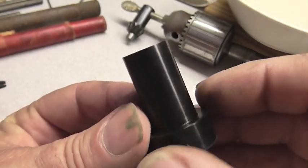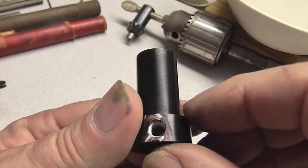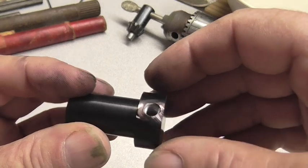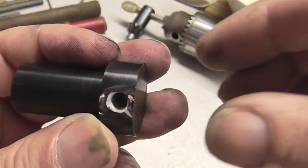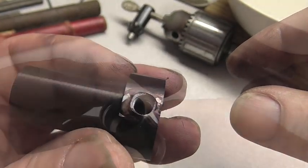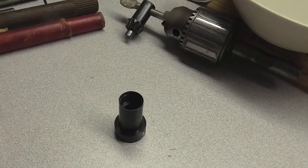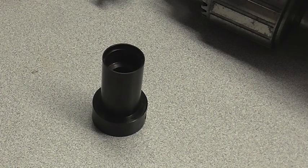A black anodized piece of aluminum, just like the customer wanted. It turned out real nice. The recipe I use out there in the shop works pretty good. This fat section is all going to be turned off, so ignore the ugliness there. One word of advice: if you ever want to anodize something and you don't want the threads anodized, you have to plug that with aluminum. As you can see, there's no anodizing on the inside of those threads. Hopefully if you want to do some anodizing in your shop, this gave you some ideas — at least how I do it. Seems to work pretty well. Please hit the subscribe button if you enjoyed what you saw, and hit the like button — it helps get the video shown around. This is Richard, the channel is Making Something from Nothing, and I appreciate you watching. Have a great day.